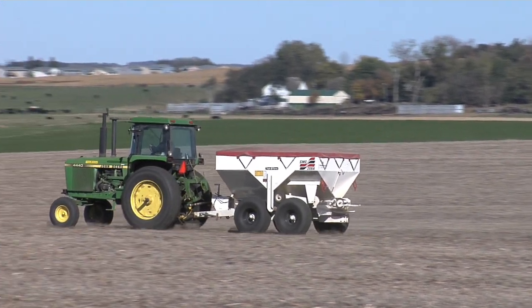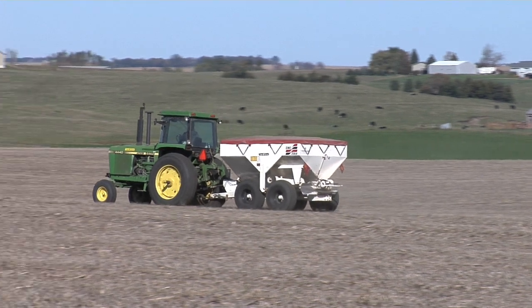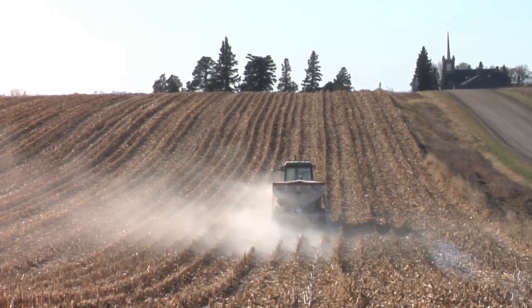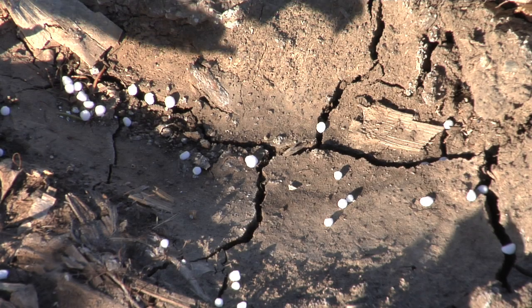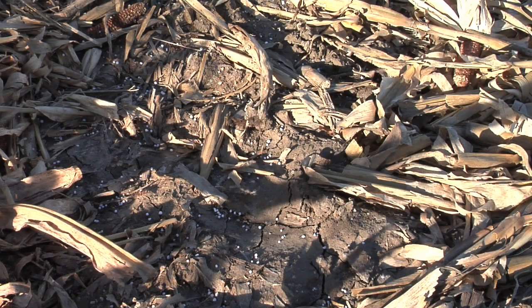One of the things you do need to be careful with is your spread pattern and how wide your passes are. If this spreader is rated for 100-foot passes or 50-foot passes, you really need to do a little checking yourself. Catch that fertilizer, and what you want to use for the outside of your spread pattern width is about half of the maximum rate caught — that's what your spread pattern is. So say you're spreading a fertilizer blend on your farm and half of the fertilizer gets caught within the first 40 feet, then that's how soon you should turn around. You should have 40-foot passes, and then you'll overlap some on the outside for sure, but the outside of that pattern isn't going to be spread as heavy as a little bit closer to the middle.